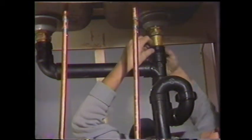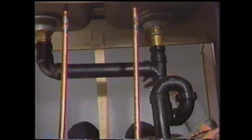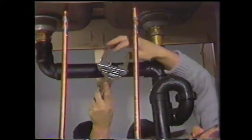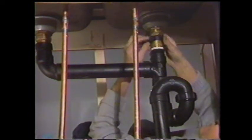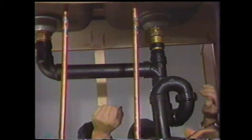You'll find, I think, that these are just hand tightened. Now, there is a wrench available, an adjustable wrench, so that it will fit and will adjust over top of that nut. But these are just hand tightened. There, they have a pressure type washer on them, and when we pull that sink out, everything will come out. Oh, that other one's tight. There. There, that's coming loose. Now, if we were to lift that sink, providing the taps were out, it would come free and clear and be ready to place the next one in.